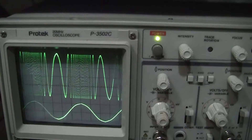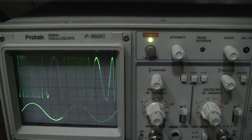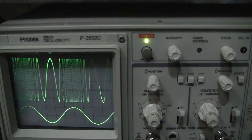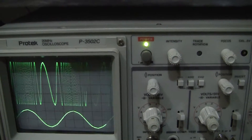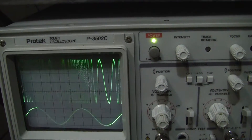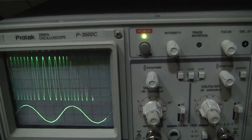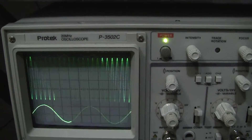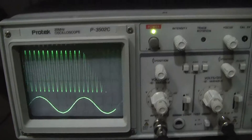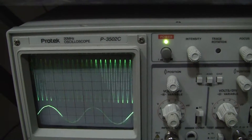What you hear in the loudspeaker — I'll turn it up a little bit for you. Let me just lock the phase a little tighter, there we go, and turn up the volume. You can actually hear the lower tone as well as a buzzing or higher tone — listen carefully. Now listen as I reduce the level of modulation. Isn't that interesting? That's how frequency modulation sounds. As I increase the depth and percentage of modulation once again, I can fine tune that phase and stop it from sliding relative to the other signal.